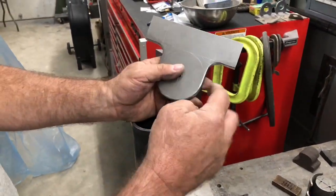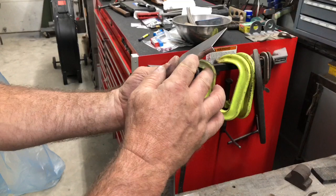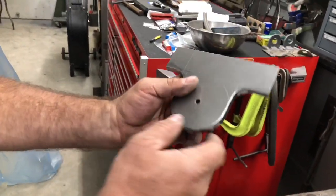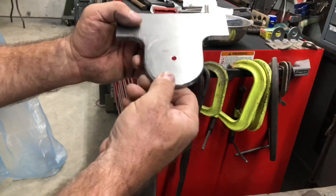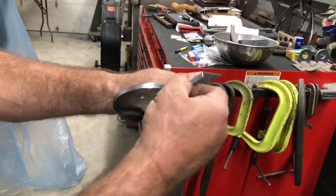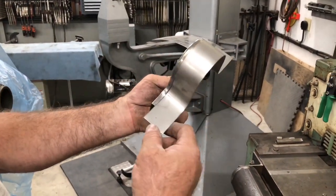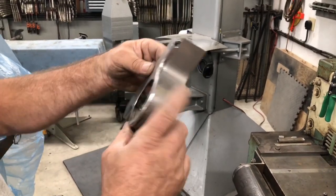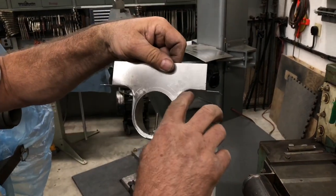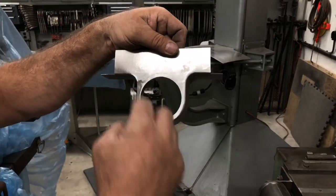This is the basic shape that we have now. This top flange is going to get folded back so it'll bolt up from underneath the dash. Then we're going to put a band around the complete perimeter to bring this back a little bit more, and it'll be welded along that seam. This needs some fine-tuning — shrinking a little bit here and there — but that's the basic process of doing both the tuck shrinking around the outside and linear stretching on an inside corner to give you a shape like that. This band is going to go around the outside and we'll TIG weld that together. That's basically what it's going to look like hanging underneath the dash. Once the weld is dressed on the backside, we'll bend this over, and it'll have bolts going up through the bottom of the dash to hold it. And that'll be our AC vent.